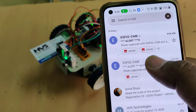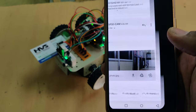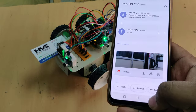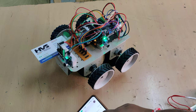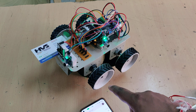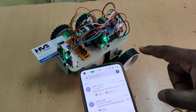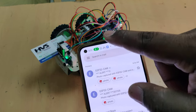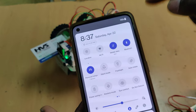Despite a little low data speed, we got the email and this is the image we have received. Now for a recap of the steps — write these down before demonstrating the project. First step: keep the battery under full charge. Second step: turn on the hotspot and data with the name specified in the video. Third step: when you turn on the kit, you should see one device connected in your mobile phone. Only then can photos be sent.